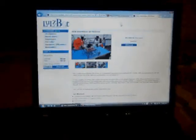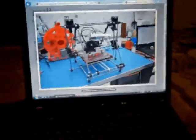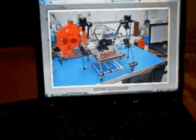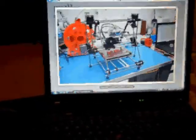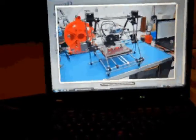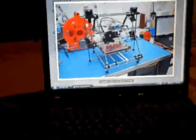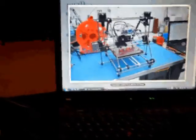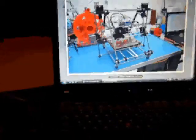I also wanted to show you the other one — this is a Lulzbot Prusa Mendel. It comes in an assembled version for $1,200. It actually has a Wade's extruder, which is nothing wrong with that. It uses the conventional pulleys, not printed pulleys, but they use fender washers with a bearing between the fender washers, and printed couplings. It looks like the standard build you would assemble yourself if you sourced out everything yourself.